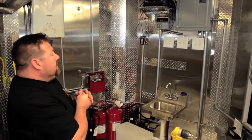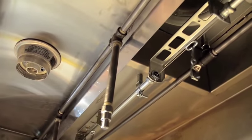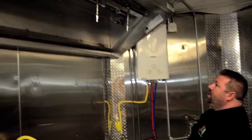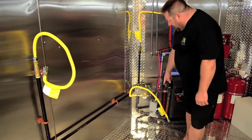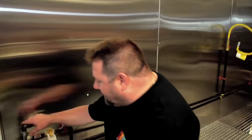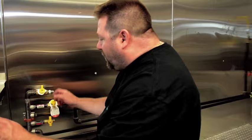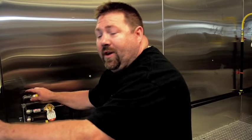We've got to caulk all the diamond plate to make it fully sealed, and then the rest of the fire suppression system — this system is built by Protec, it's got two individual bottles. Since it's a 15 and a half foot hood, we have some finish trim to do and then we can throw in the filters and drip pans. As you come along you'll see our three-quarter inch propane trunk line with a shutoff valve connected into the fire suppression system. Every single gas appliance should have its own shutoff valve, and we install manifolds so someone can reach in and quickly shut off appliances if needed. The fire system is there to protect you from fire, but if something goes wrong with equipment you can shut it off quickly from the shutoff valve.